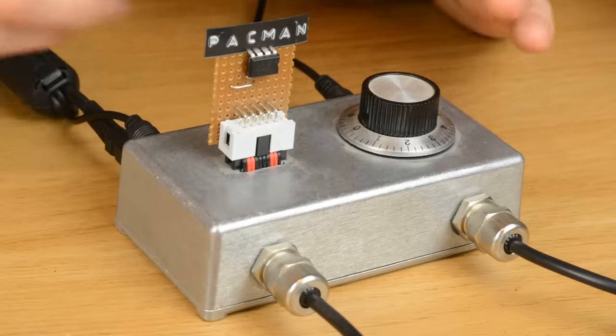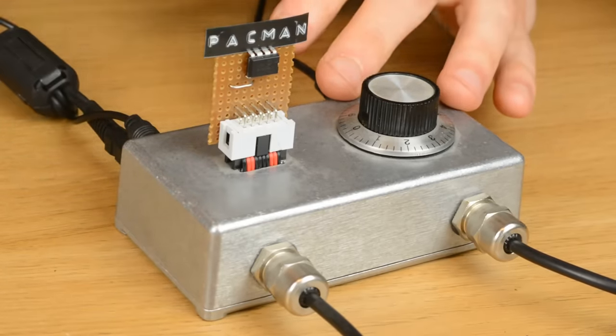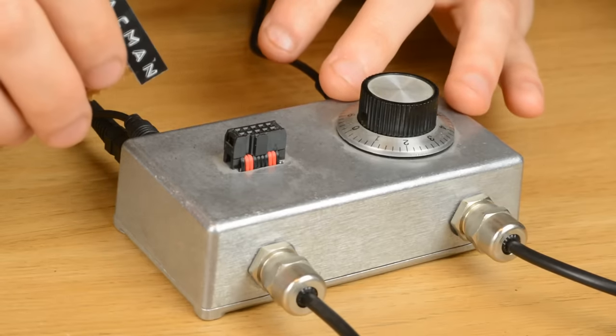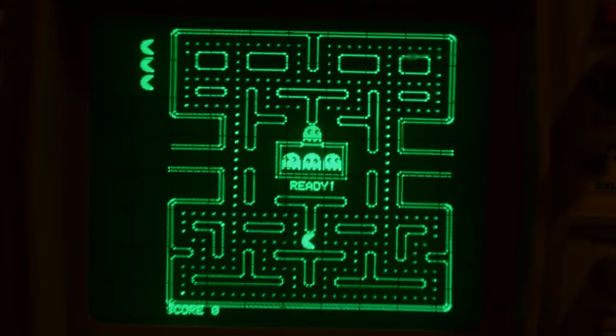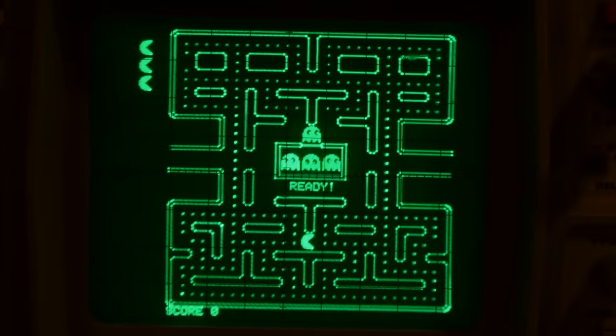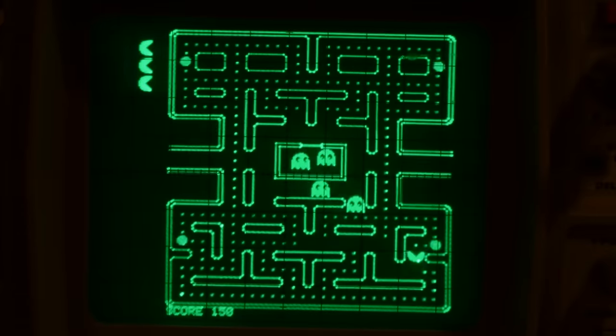Anyway, to maintain the illusion of running from the cartridge, there's a pin change interrupt that fires when the cart is pulled out, that kills it, and goes back to the insert cart screen. I have a weird compulsion to get these games as accurate as possible.